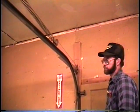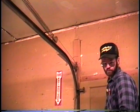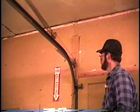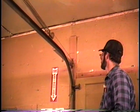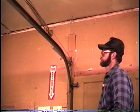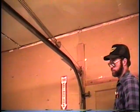So when you go to replace a stretch spring, the door is open. So you'll have to get the door open. You'll need some help. And you'll either put a 2x4, ladder, something under it, so the spring is back to itself and it's not stretched when it's compressed down. That's when you'll replace the spring. When it's stretched like this, it's impossible. So to replace the spring on a stretch spring, the door is going to be open for us.